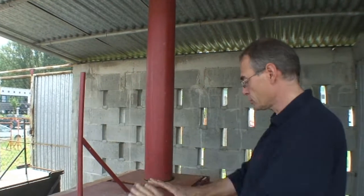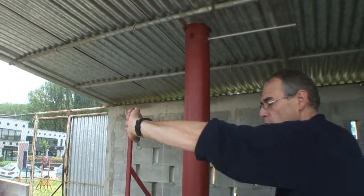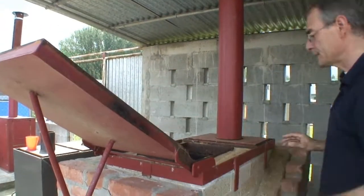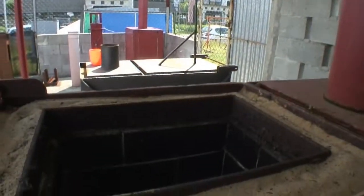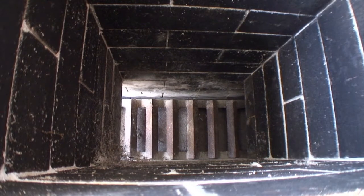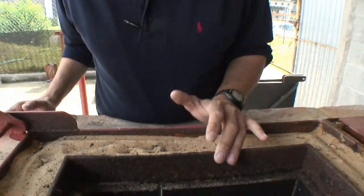What we see here is the top frame with the loading door and then the chimney spigot with its chimney going through the roof. When we open the loading door we can see that this is a very small primary combustion chamber, followed by a secondary combustion chamber — though we cannot see it fully because the chimney should be taken off. If we look inside, there is actually a tunnel going from the primary to the secondary. In the primary combustion chamber is where we put in our medical waste, but before we do that we always preheat it with some paper, small wooden parts, and a little kerosene to make it easier to get the fire started.